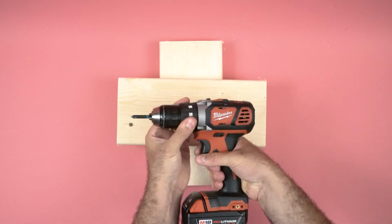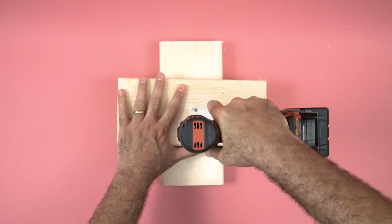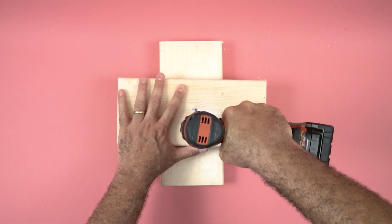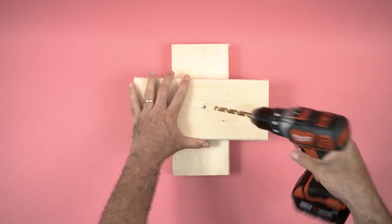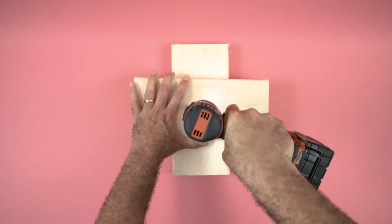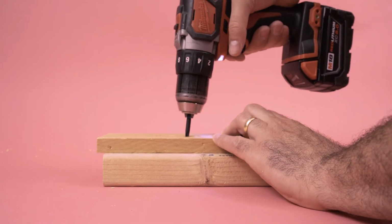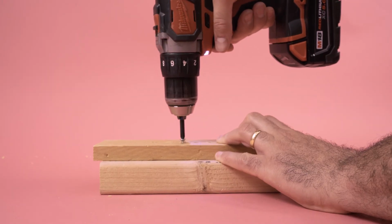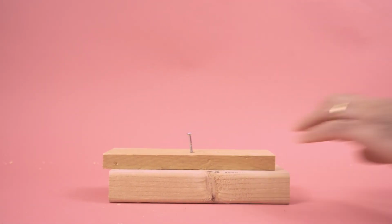There are many more things to keep in mind when using a hand drill. Don't over-tighten anything. Drills are dumb and powerful. They will keep driving and break your material or strip your fastener. Don't try to remove a screw with the drill bit. If a screw is stuck, use high torque and low speed to remove it. You don't want to strip or break the head.